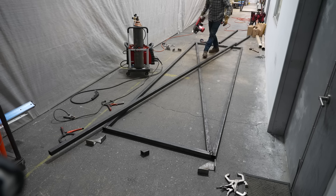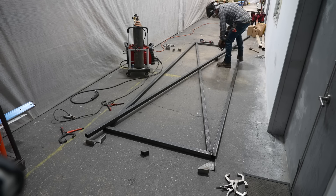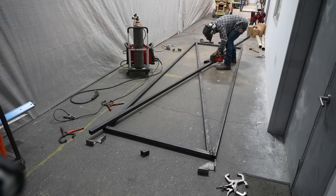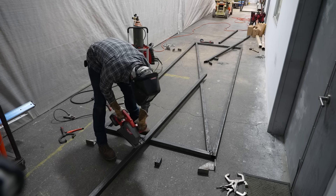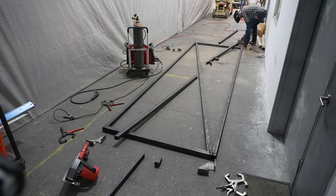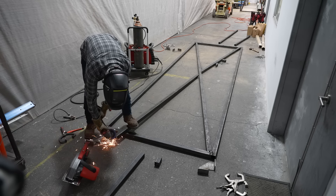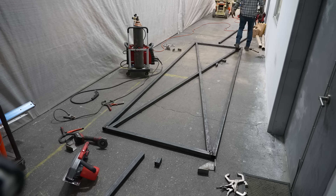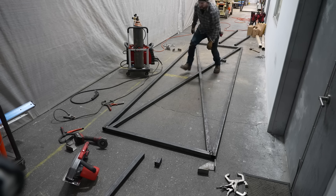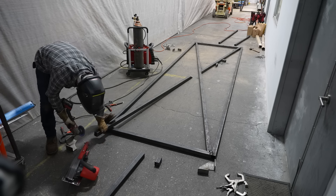For those that will ask, I'm using a Diablo Cermet 2 metal cutting blade — it's the same blade I always use and talk about in all my videos. It's very good. You can get a couple hundred cuts out of each one, but once they're dull you need to just know when to give up because they really stop cutting once those carbides start to wear out. So just always buy two so you have a backup. It's much easier to line up this cut because everything was marked on a continuous piece, but I still have to get down on the ground, sight it, and make sure everything fits with the grinder so it all lines up really, really well.